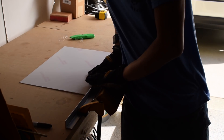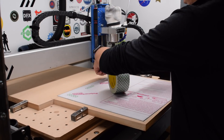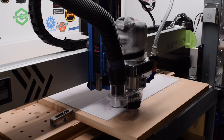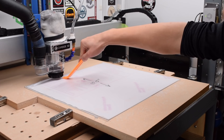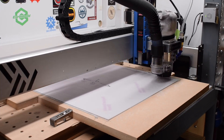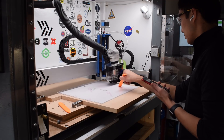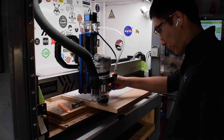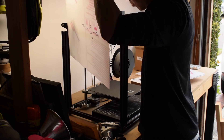Polycarbonate is pretty easy to cut, especially if you have some plastic-specific end mills. For most of my cuts, I'm using an Amana 1/8 inch single flute end mill — shameless plug, Carbide 3D sells this as part of a plastic cutting end mill kit. Feed rate was a fairly conservative 40 inches per minute with a 1mm step-down, just to infuriate both the imperial and metric camps. RPM was in the neighborhood of 15,000–16,000. I really wasn't too particular about the setting on the router. I was perhaps a bit too stingy with my double-sided tape, and I am 100% correct on that. But I also didn't want to use clamps and tabs here, so a little manual assistance was required to keep the polycarbonate from being yanked off my table. Once these panels were cut out, I slotted the sides and back walls into the frame.